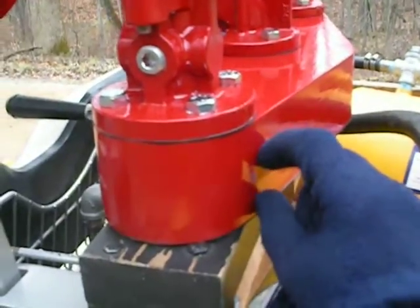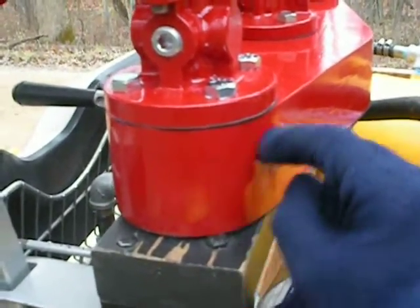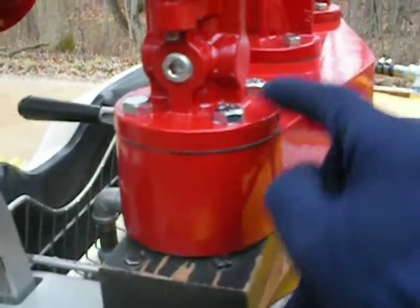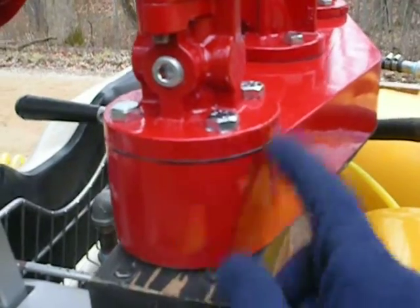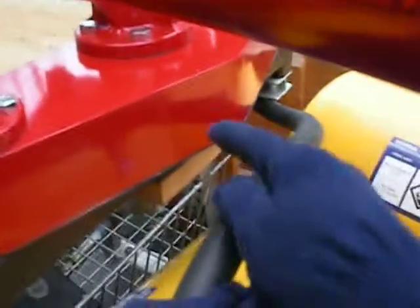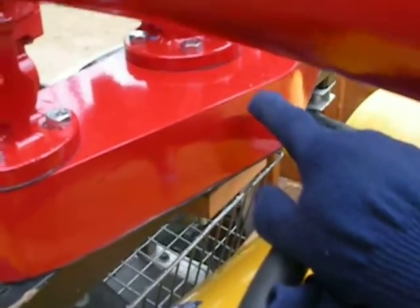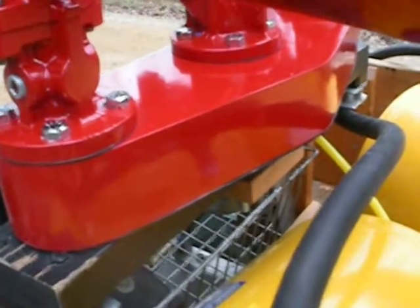The middle slab, I took a router and I routered in the air channel. So I have an air chamber for all three horns, and then a center. Let's see if I can get a little better shot. I can't. The center, I really can't see it well there, but anyway, I have a 1/2 inch fitting coming right up in the center, and then it tees off and goes through the power chamber, through the manifold.